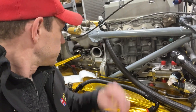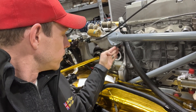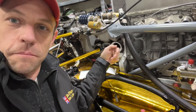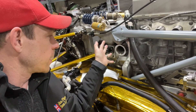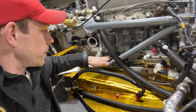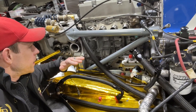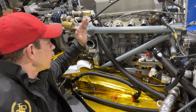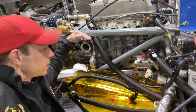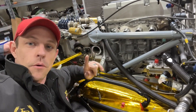The block is fully bolted here at where the bell housing would have been, and the clutch in fact goes down in here. It's bolted onto this thick billet aluminum adapter plate which goes to the transaxle. So it's constrained in the rear and constrained on this full flat plane here. The engine will help with any torsion, and it effectively triangulates — if you look from a high point going down to the pins here — the engine creates a triangle.